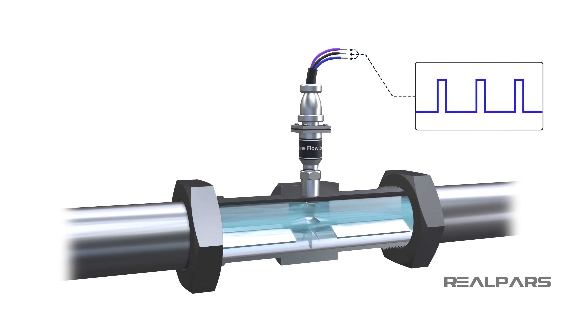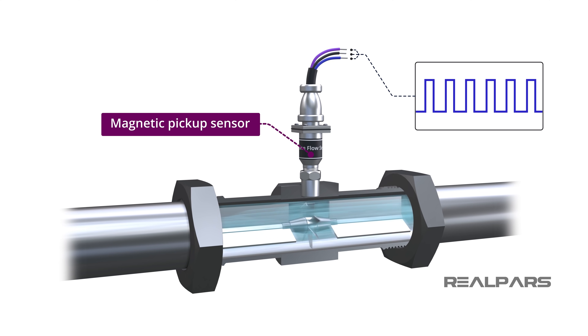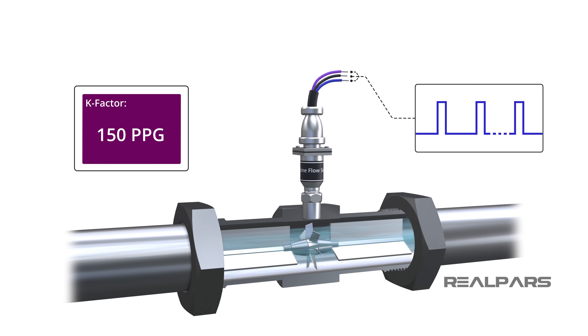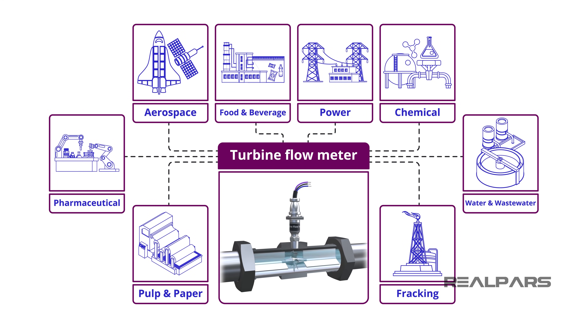Let's review. A turbine flow meter is inserted in a pipe directly in the flow path and has a turbine rotor placed in the path of a flowing stream. The higher the rate of flow, the faster the rotor turns and the greater number of pulses generated by an electrical pickup. In most applications, a turbine flow meter is used to measure volumetric flow rate. Every turbine flow meter has a unique K-factor stating the number of pulses that will be generated for every unit of product passing through it. There are several important issues to consider when installing a turbine flow meter. Considering their popularity, there are very few industries where turbine flow meters are not used.